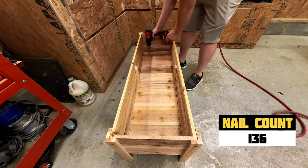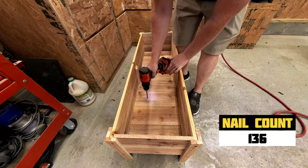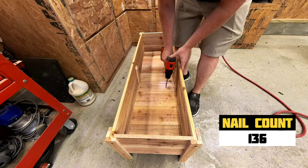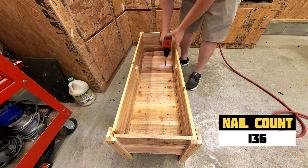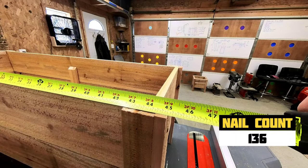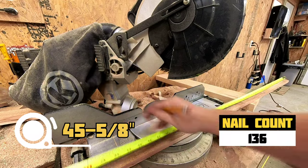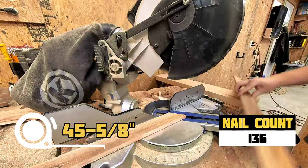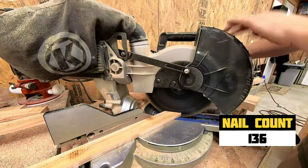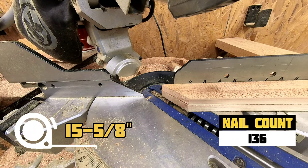Drill two 5/16 inch holes in each of the bottom boards about two inches from center on the long sides. Most of your water drainage occurs when the dirt dries and leaves a space around the inside of the box, so you want the drain holes closer to the interior so the dirt has some time to absorb the water. For the lip, measure the box's assembled width — mine was 45 inches, so I am cutting my tops to 45 and 5/8 inches. Make a little triangle guide and cut two of those. The short sides measure out to 15 inches, so I cut those to 15 and 5/8 inches to match.